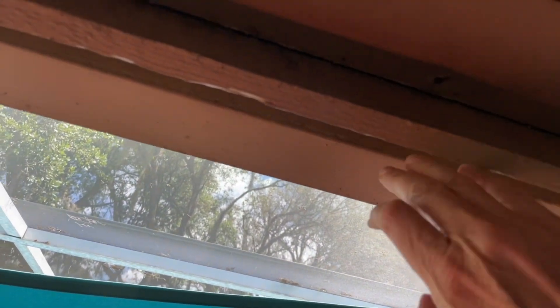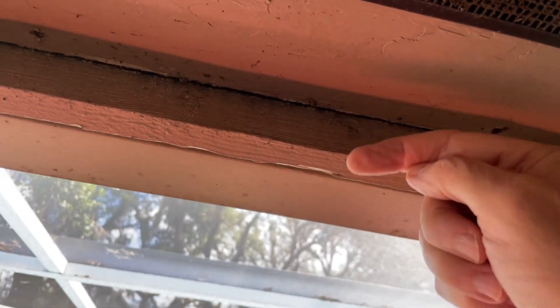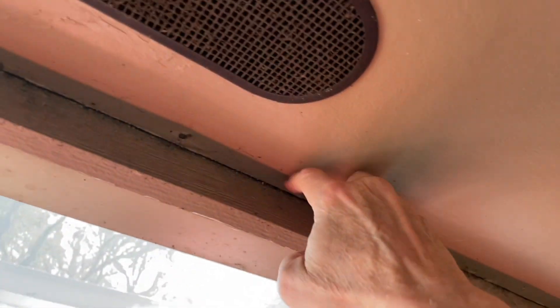The reason why is because gutters often overflow, either because they aren't cleaned out or maybe it's raining especially hard. What happens when they overflow is the water gets back in behind the fascia, and if it can't get out of the soffit it'll start collecting and causing you a great deal of misery in the name of wood rot.